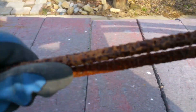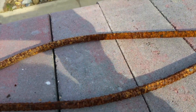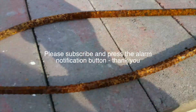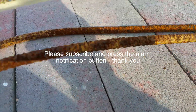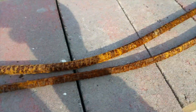I want to talk about rusted rebar and its function and usage - it's scrap. Don't even put it inside the wall. It can expand; if you have concrete around it, this can act as a wedge as it expands. The rust, the scale - everything would have to be removed to make this material usable. Do not use it.